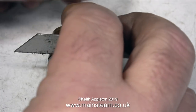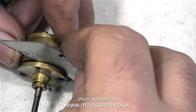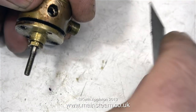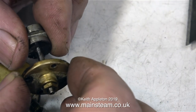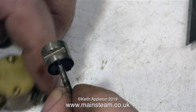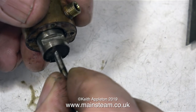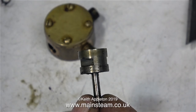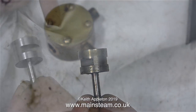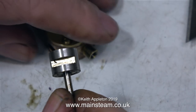I'm using one of these extremely sharp blades to remove the top, which it does very well without marking the unit. The machining tolerances on this component are very close — very close indeed. Not just on the stainless steel part, but the inside of the valve also. The body of the valve, which is made from phosphor bronze, is machined like a cylinder. Everything needs a really good clean, and by looking at it, you should be able to figure out how this valve works.